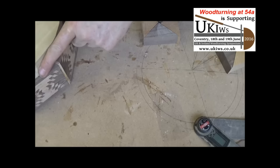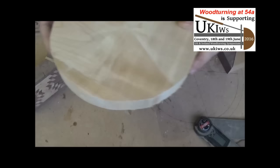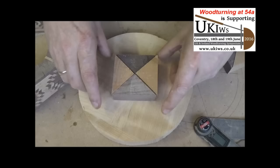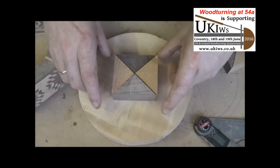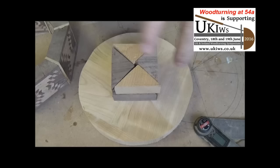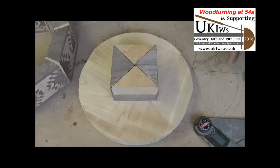The base is roughly cut to a round on the bandsaw — I didn't bother getting the jig out, just done it freehand. It's going to be turned anyway. I've decided to put a little pedestal on it, and just to keep in with the feature of two kinds of wood, I've cut these little wedges from a block of three-inch square — straight down, corner to corner. You've got another row which I'll put on opposite, and that will be rounded off on the lathe. The base will just be another plain cherry base — the foot of the thing to finish it off.